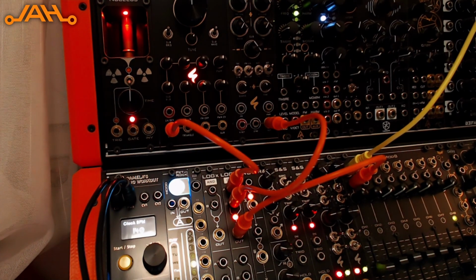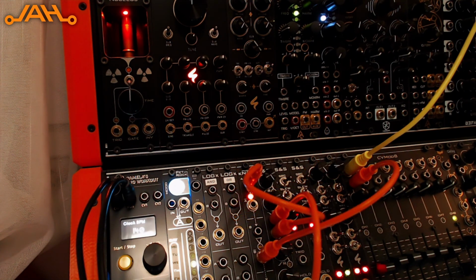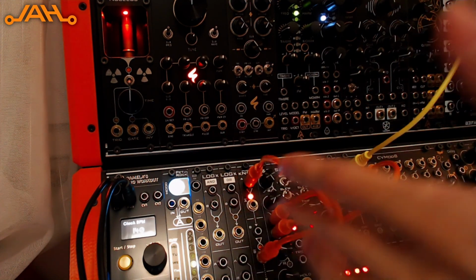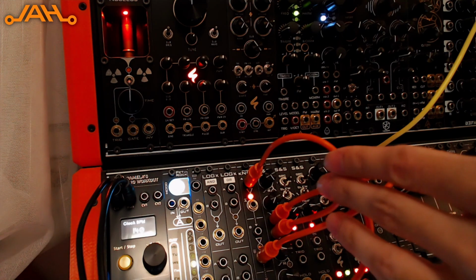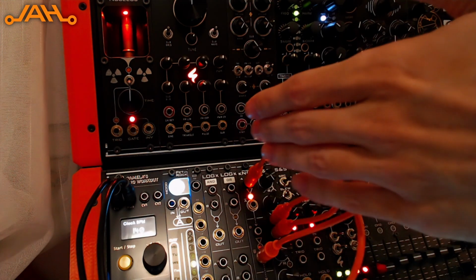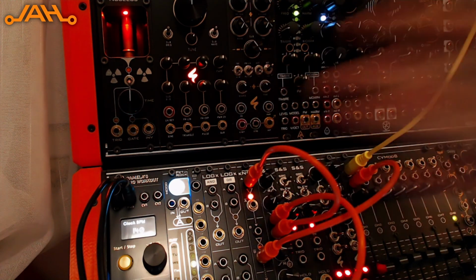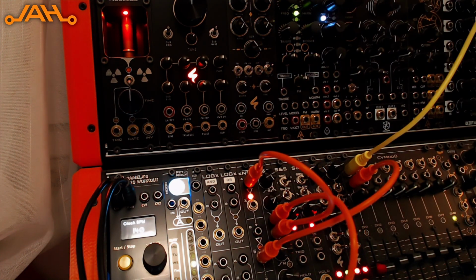Now we will play around a little bit with kNOT because it has its own very, very cool audio functionalities. Okay, so kNOT in itself is 3x NOT gate, and if you feed the output of the last NOT gate back into the first NOT gate, you get a kind of oscillator. I will not do this directly because there's not much point. It is a static around 10 kHz. It will depend a lot on a lot of stuff, from temperature to chips themselves, etc.